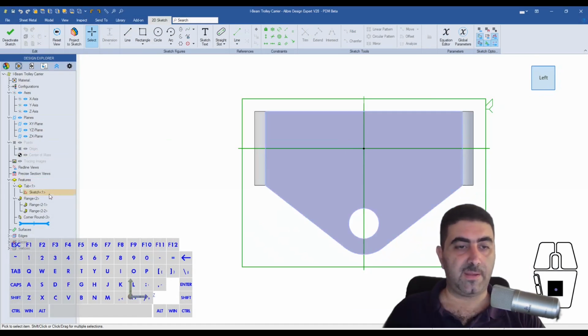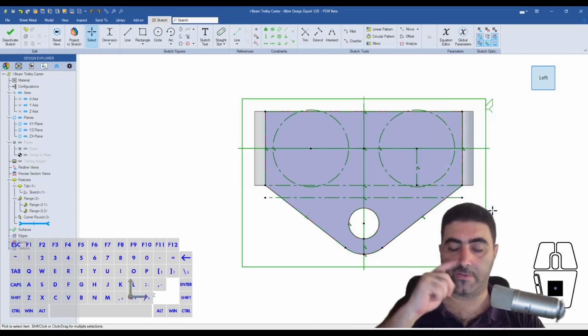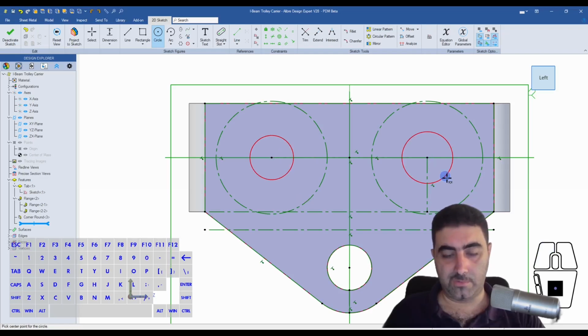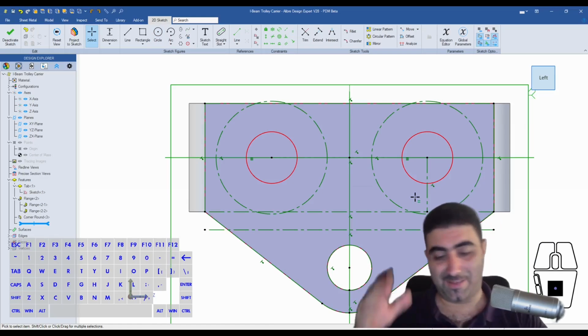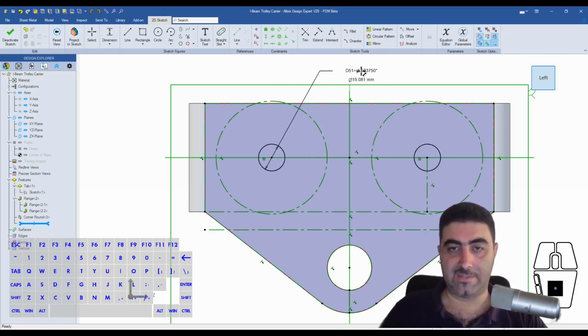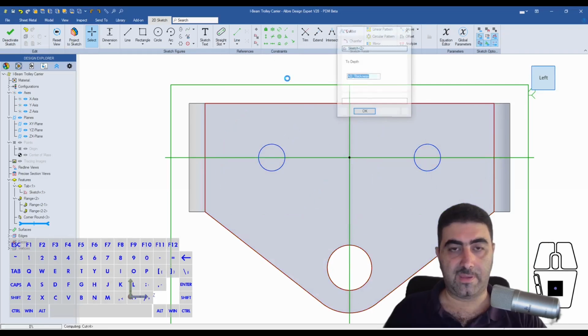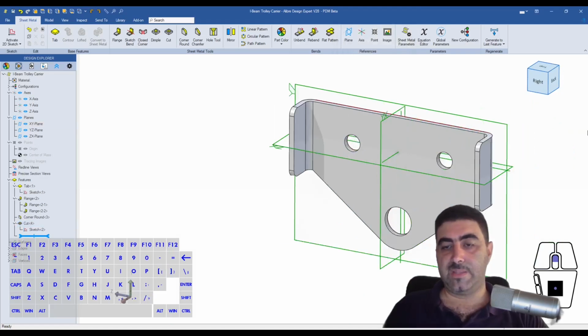Okay, we'll go back in here, right? Sketch on this surface, and I'm going to project my first sketch in. Create reference figures. I want to project the reference figures from that first sketch, and look, I have the position of the 2 rollers. So this is where I'm going to make holes for the shafts. Now that I think of it, I could have done that in the design of the original tab. Okay, and these are going to be 19/32, and there you go. Now I can cut that with the cut tool. Let's cut for the thickness of the part, and basically my carrier is ready.